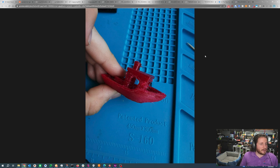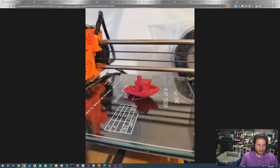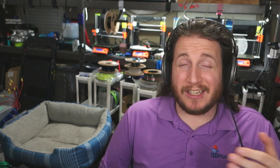It is not just squished — it looks like it's elongated as well, like someone non-uniformly scaled it in Photoshop. Everything just isn't the size you expect it to be in any axis. If this is an OG Gen 1 MK1, it is potentially time to look at changing out the machine. One of the big fixes is to make sure you don't have any binding in the Z axis, since a lot of the damage we can see is in a shortened Z axis.